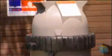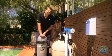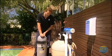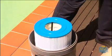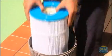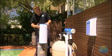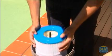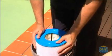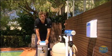Becoming more and more popular these days are cartridge filters. They're very efficient, use a lot less water, and are better for the environment. They're simple to clean and should be done about every four weeks or so. Just take the lid off, pull the element out, and hose it down — hosing down takes about five minutes. Make sure it's clean and pop it back in. Manufacturers recommend that every six months or so you soak the element in a cartridge degreaser from any pool shop, then hose it down after that.